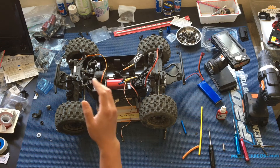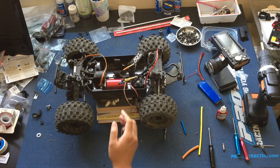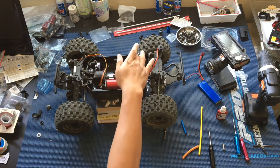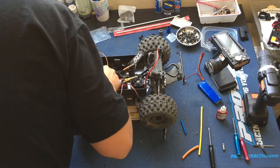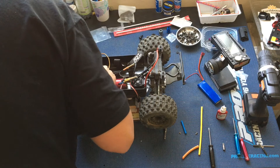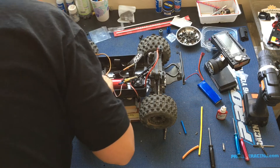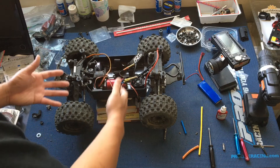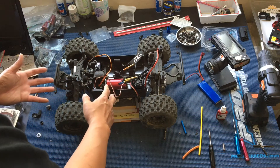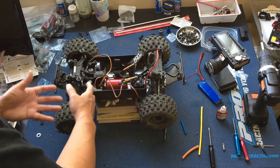So what we're gonna do is kind of clean up the wiring. You can see these bare metal connectors — never good to have bare metal connectors. I'm just gonna make sure that we have — or rather, a brushless motor, a brushless DC motor especially used for RC, doesn't have polarity. Your brush motors have a plus and a minus, and if you switch them the motor's gonna go in reverse.